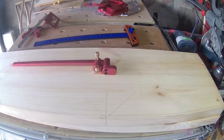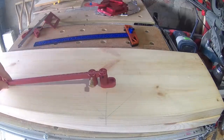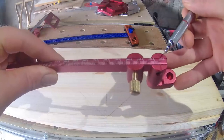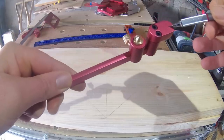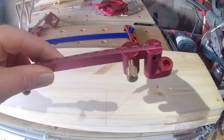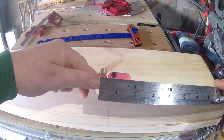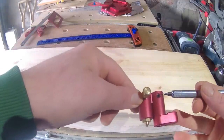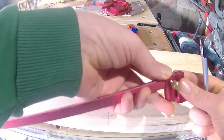This trammel is another one sent courtesy of Banggood. On first glance, a nicely made bit of kit — all alloy with bronze color pin and thumbscrews. One curiosity from the off is the measurements start at 16.5 millimeters from the hole for the mechanical pencil, with markings laid out every 10 millimeters from there. So instead of 100 millimeters marked clearly, for example, it's 106.5 — just bloody weird. With the pin butted right up to the foot, the smallest radius possible is 36mm, the largest 300mm.